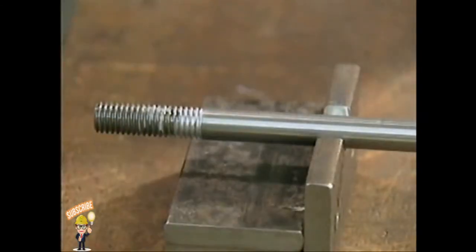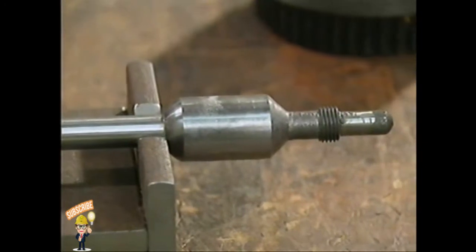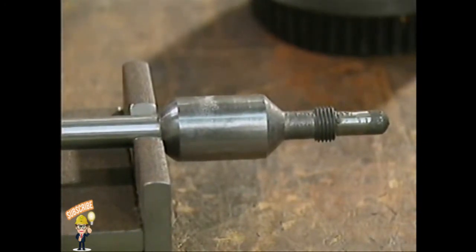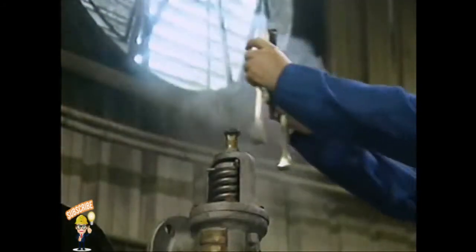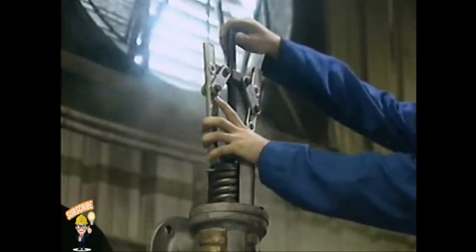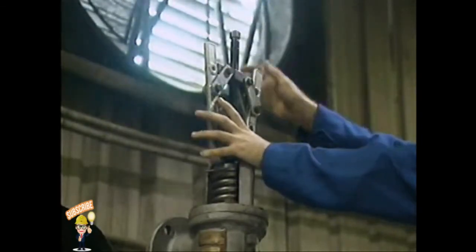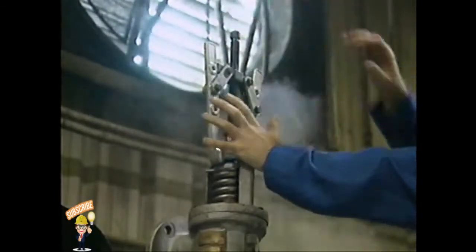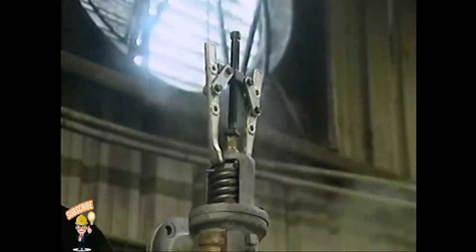It's also important to check the straightness of the valve stem, because a bent stem is a common cause of valve malfunctions. A bent stem can prevent a valve from opening, or it can keep an open valve from reseating properly when system pressure returns to normal. Two common causes of bent valve stems are careless handling and improper gagging. Gagging is the act of attaching a device called a gag to a safety valve to keep the valve from opening, and is usually a preparation for testing before a reassembled valve is returned to service.